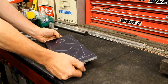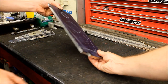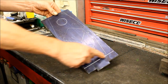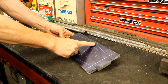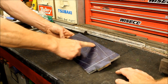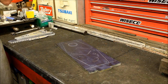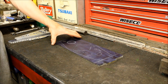So instead, hopefully you can hear us over the sound of the rain outside. There you've got a spare piece of, what's that, 10mm? That's 10mm, yeah. And I see you just made out the shape there of the new brace. They're the same shape as that, but they are actually too long. They probably want to be about an inch shorter. So you've just used that old one as a template. I just drew around it. I know they're too long, so if I cut it in half there, there's enough room. I can get them bolted on there, and when the wheel and tyre is in, you want at least half inch clearance between the spaces and that.